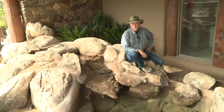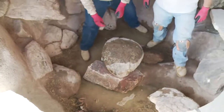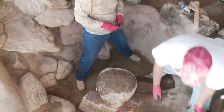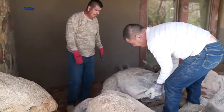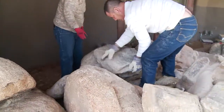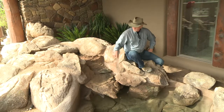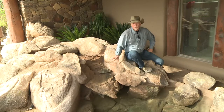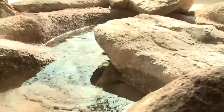The other focal point of this courtyard is this water feature. Some type of water element would be common in a French country garden, and this one certainly fits the bill. What we did is we excavated this out, shaped the upper basin, and brought in all these beautiful boulders. We have a PVC liner, we've run our plumbing, put in a colored concrete shell, and after we selected really nice boulders for our falls and got them all in place, we're going to have the effect we want with the water flowing over them.